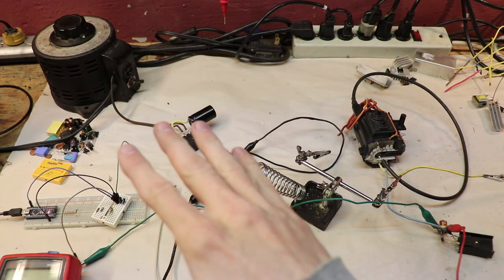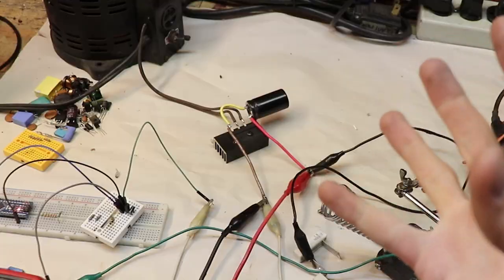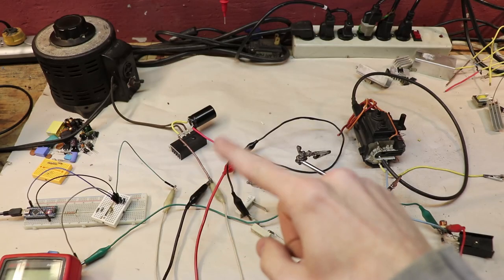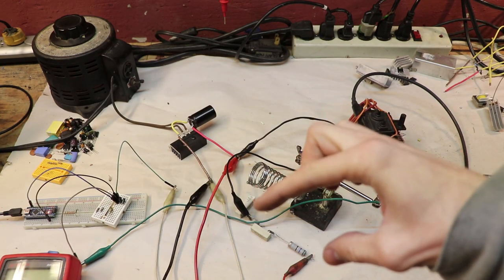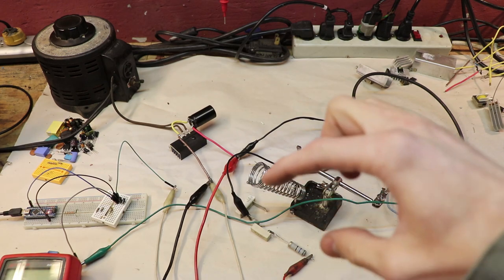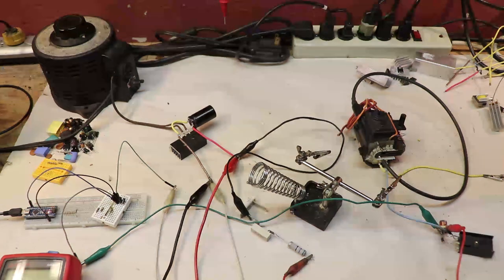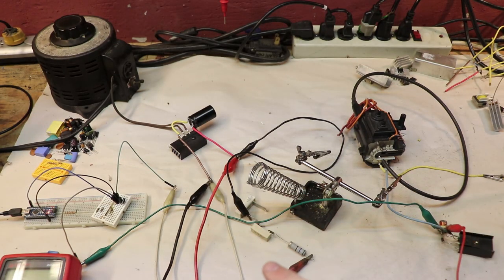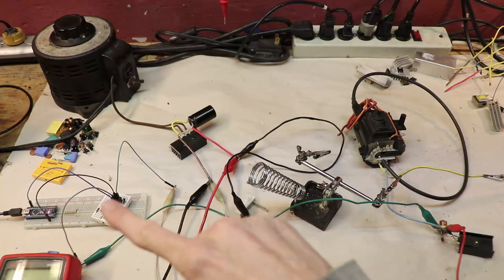So we're going to have a voltage of 25 volts coming from the variac. That's going to be filtered by a full bridge rectifier. So that connection goes to these resistors, and this is just one big resistor that's 330 ohms approximately. And this is copying the resistance that I saw on the board itself. So past these resistors, the voltage goes into the transformer and then goes all the way over to the collector side of this jelly bean transistor.